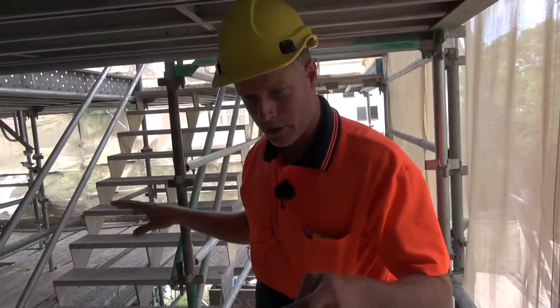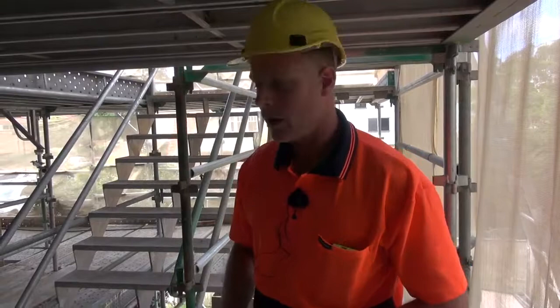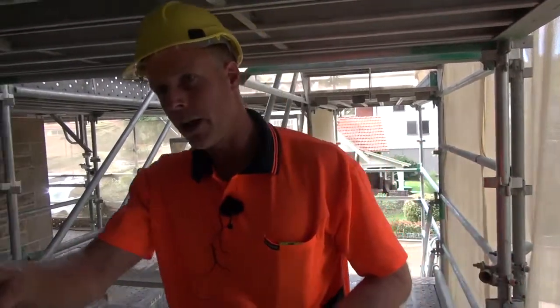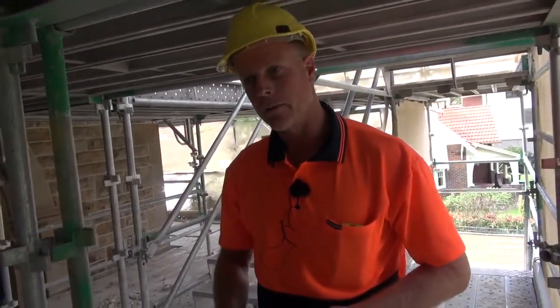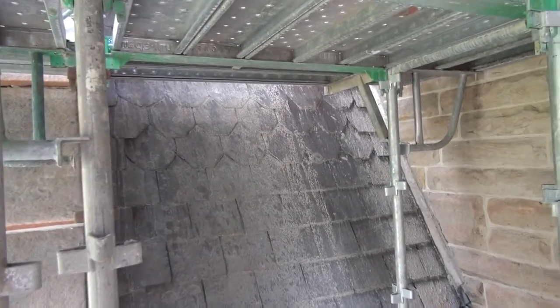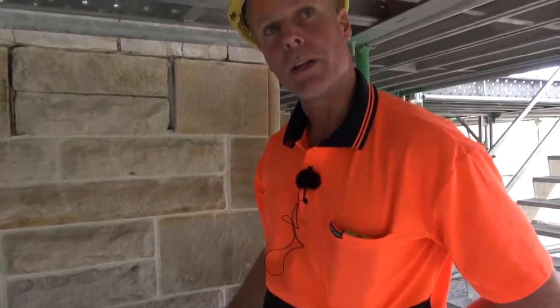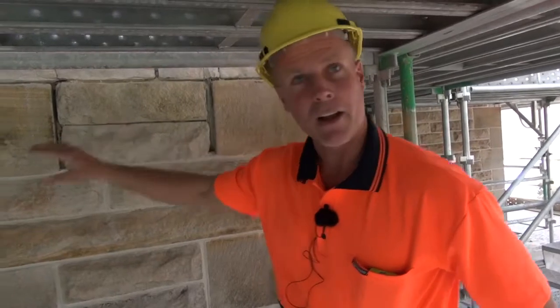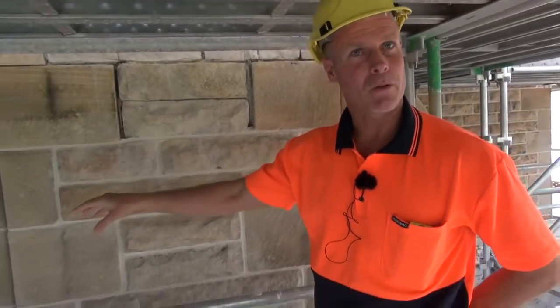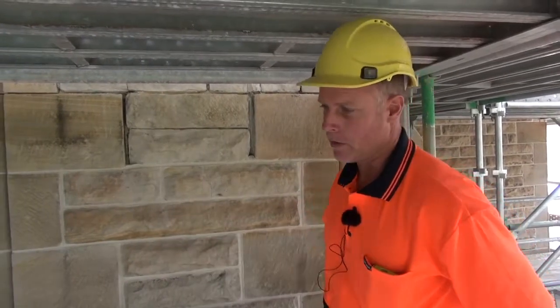From this point down, it's just a depoint, repoint — putting new gutters, downpipes, making sure everything's watertight. Right behind you there, that'll be re-slated, re-leaded, so everything will look really nice. We've got the fishbone pattern there. That is one of the things that can happen on a sandstone building — because the sandstone's constantly wearing away, the gutters can get full, downpipes blocked with all sand, sediment, and chips, which can cause other problems.